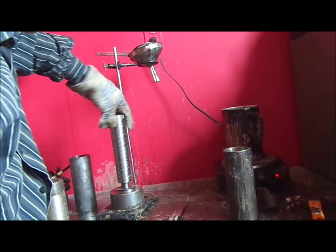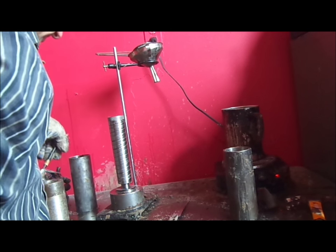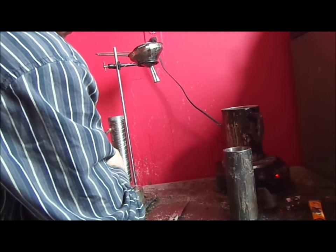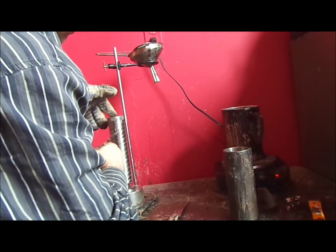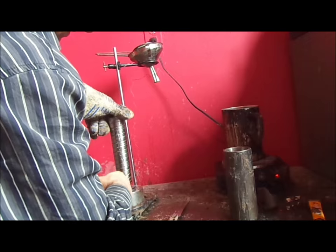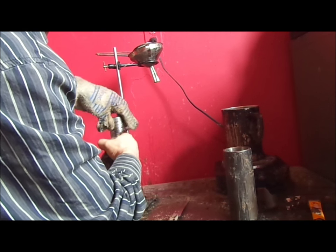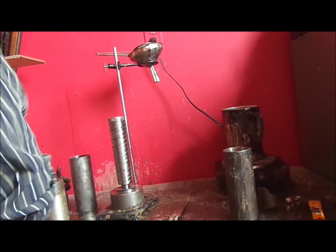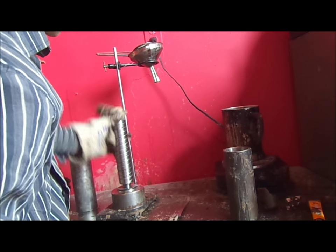So first thing we need to do is we have to lubricate the mold. Again, we get our mineral oil. Put a little there so it unscrews easily. Apply a good amount of mineral oil on, especially up here. This gives a nice bearing surface for our mold to release the record.